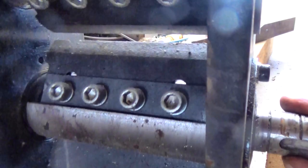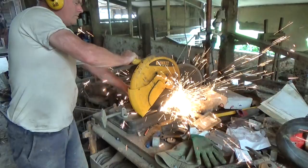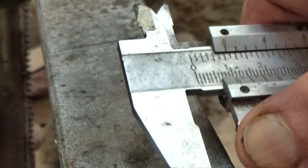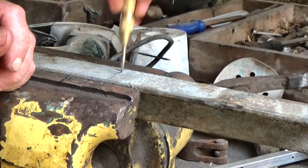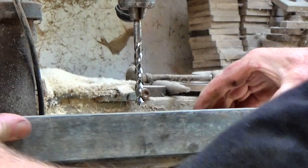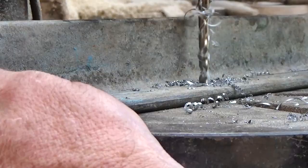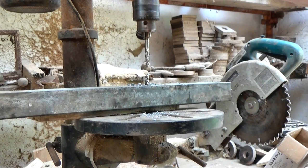It looks great, doesn't it? Totally terrifying obviously, but what a great start to the project. There's still plenty to do before we can actually chip with it. First I need to stand it up and bolt it down onto some sort of frame so it won't move. Luckily there are some threaded holes in the steel plate itself and some machine bolts to fit, so it was easy enough. I just found some chunky angle iron and drilled some holes in it — some of them in the right place — though even drilling holes can take longer than you'd imagine.